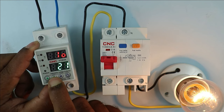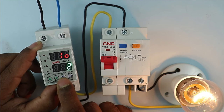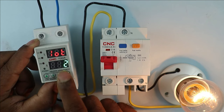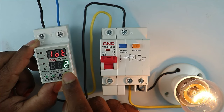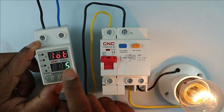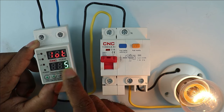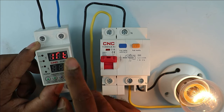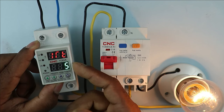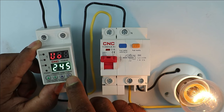For now, I am setting the overcurrent to 2 ampere, and I will connect a load to show how it works. When 2 ampere is set, press the M button again. When overcurrent occurs, after how much time this will provide protection — we have to set this time here. It is 2 seconds now; let's change it to 5 seconds. This means when high current starts flowing, after 5 seconds this device will provide protection. After this, you can also see and program the reset time — after how much time you want this device to reset.